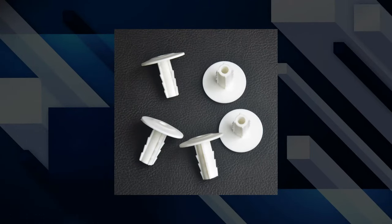Let's talk about something I see all the time that drives me nuts — how to not weatherproof your cable. If you've ever seen a cable penetration done by a big cable company, you might have seen these plastic bushing things. They don't actually do any weather sealing. What they're meant for is to provide a smooth surface for pulling cable through the wall, or to prevent the cable jacket from scraping against metal siding. On their own they don't provide any weather sealing, and about 95% of the time I see these in the field they've slid out of the wall. If you do want to use a cable bushing, make sure you're using it in conjunction with silicone so that you actually get a weatherproof seal.